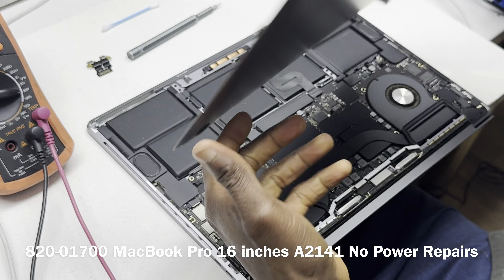We're going to use a multimeter set to continuity mode. If I join my probes, we get a beep — that tells me the probes are good. We can use any screw hole as our ground reference. To say we have a short to ground means whatever we're measuring has a path to ground when it's not supposed to. A fuse should not be connected — if it beeps, we have a short on our PPBUS line.